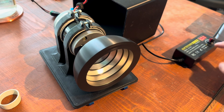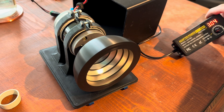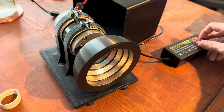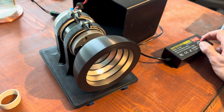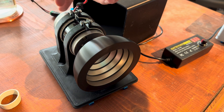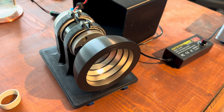For power, I use just a regular DC power supply. You don't need any motor drivers or anything else - just a regular DC power supply to power the DC motor. This is a 12-volt DC motor and I use a voltage of around 12.1 volts to get a rotation speed of 3,350 rotations per minute.